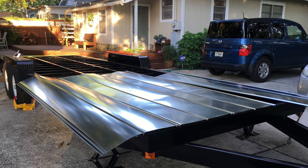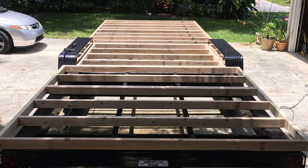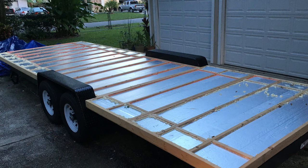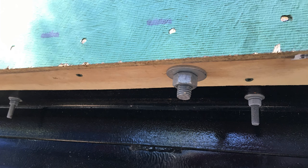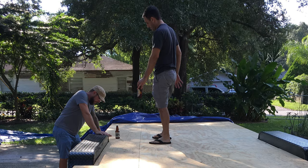With all those feelings at play, we got to work by cutting metal roofing panels to protect the underside of the house, framing the subfloor in three sections, installing rigid foam insulation, and attaching all of it to the trailer using around 70 galvanized bolts. We were mindful to countersink each bolt so that the subfloor plywood would have a nice, smooth surface to go on.